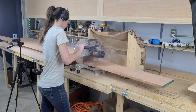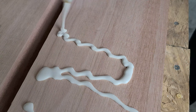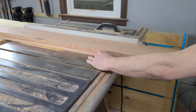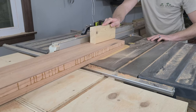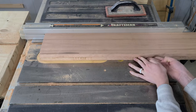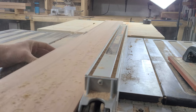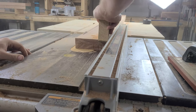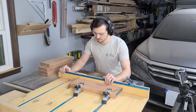The headboard supports will hold our headboards at a slight angle to make relaxing on the bed easier and allow the headboard to move from one side to the other. To avoid having to buy another 15 foot, 2 inch thick board that we only needed half of, we bought a 1 inch wide board instead and laminated it to be 2 inches wide. This added some time to the project but eliminated a lot of extra scrap material and saved us some money. We quickly rip one of the glued edges off on the table saw and then flip the board around, set the fence and rip it to its final width. Then we grab our crosscut sled and chop the board down to form the blanks that we need.